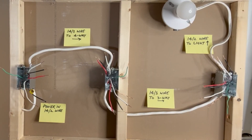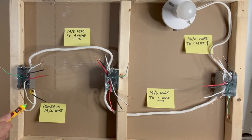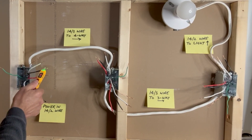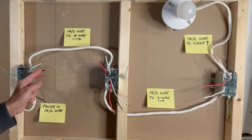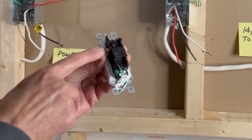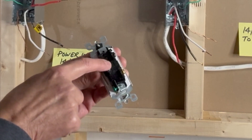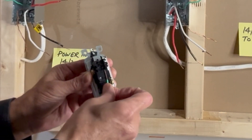So let's start installing the switches. Safety first — always make sure that there's no power in any of the wires. I will use my Klein Tools touchless non-contact voltage tester to make sure there's no power. There's no power in any of the wires, so it is safe to proceed. You might notice I have already stripped these wires. If you are not sure how much wire you need to strip, there is a strip gauge at the back of these switches — in this three-way switch there's a strip gauge you can check.